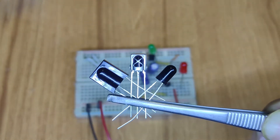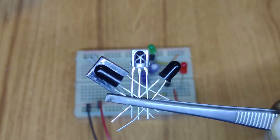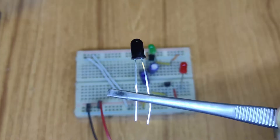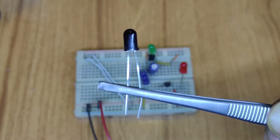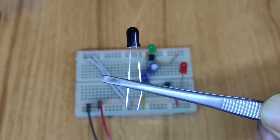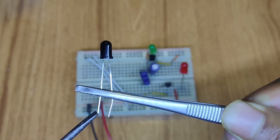We will learn what is the reason to use a receiver circuit and what is the circuit biasing for each sensor. Let's first try this two-pin IR receiver. This is also an infrared receiving circuit. It has two pins — like a normal LED's anode and cathode — but these are not standard: the bigger pin is the anode point and the smaller pin is the cathode point.